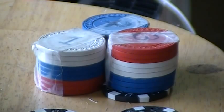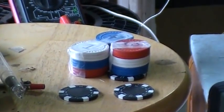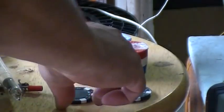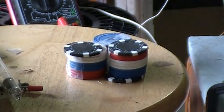It's also a heterodyne system. We're not going to go into that yet. The heterodyne causes it to cycle up and down in value, but you can see that on the scope, and the periods of one complete cycling around each other. Okay, however, here now we're putting secondaries on this system. Those are represented by that black checker with white stripes around it. And blue is phase two. We got a secondary under there, and we got to put a secondary over phase one and phase three. We're going to put them in series.